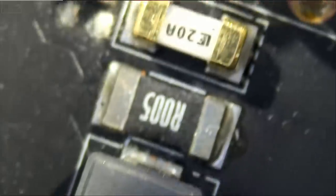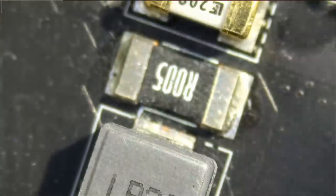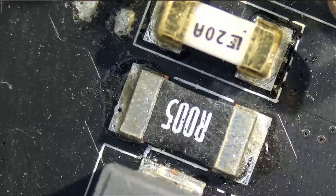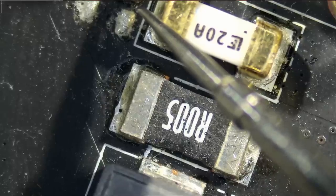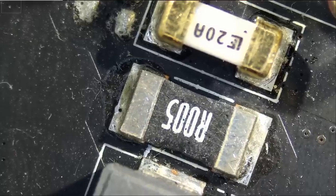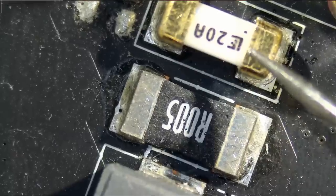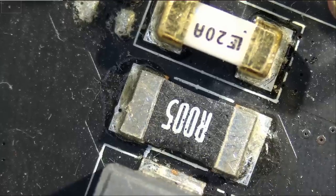We're going to measure at the third connector here, or at the fuse, or at the current sense resistor, or at the inductor. Any one of them will do. Meter in continuity mode. And do we still have a short? And the short is gone. We are now reading 387 ohms. If we go to diode mode and we measure here, 0.39 voltage drop. 0.39, 0.39, 0.39, perfect. The short is gone.